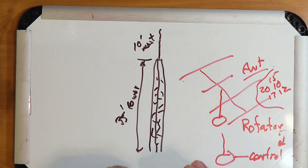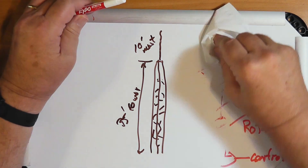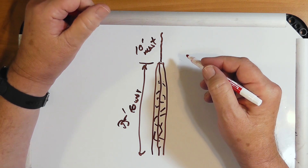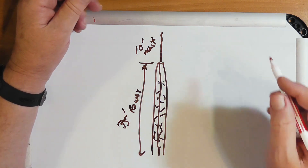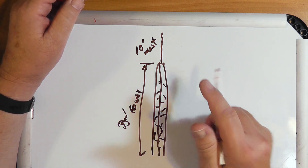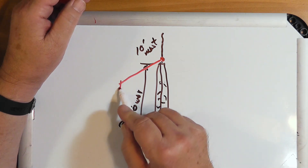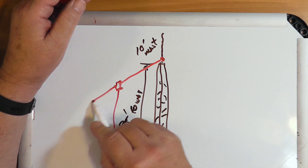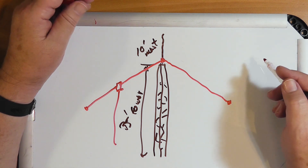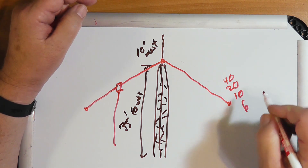So that's one thing you can look at — that's a horizontal antenna. Now we can go to the opposite, the less expensive solution. Each leg is about 33 feet, and you could mount it as an inverted V. You have to have an insulated spot above here because the actual coax comes out at the one-third point down, but that could just loop up and over. And that will work on 40, 20, 10, and 6.